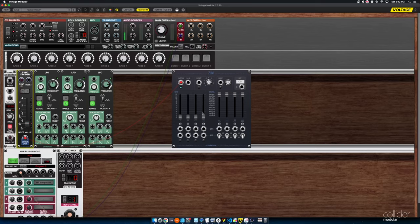Now the way this works is there are 8 channels, and each channel has a slider that indicates an interval. It has a gate input, and then a little bit of opportunity for modulation, which I'll talk about in a second. We can set interval values. You can see here I chose 4 semitones, maybe I'll do one with 7 semitones, an octave, and then maybe that one will be 2 semitones. Even though we have set these values, we're not getting anything yet on the output other than C0, which corresponds to 0 volts.